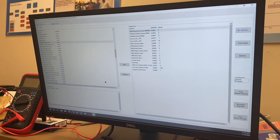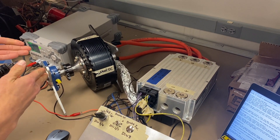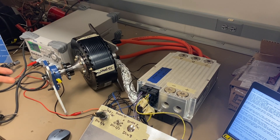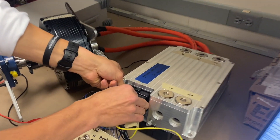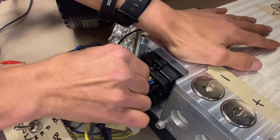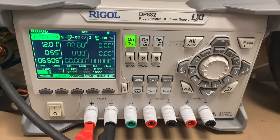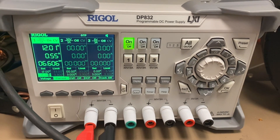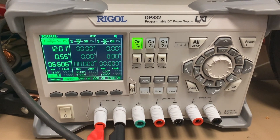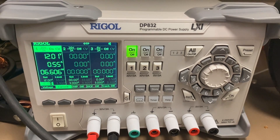One of the first stages in implementing the inverter to this motor is flashing the EEPROM hardware with updated firmware. To do this, you need to pin the program enable pin to J17. You will notice that when you recycle power, the voltage will stay the same but the current will go down. In the normal state, the logic system runs at 12 volts and around 0.67 amps, but at a lower current, this indicates the inverter is in a program enable state. In this state, you can use C2 Prog to reflash the firmware on the inverter to accommodate the motor you are using.